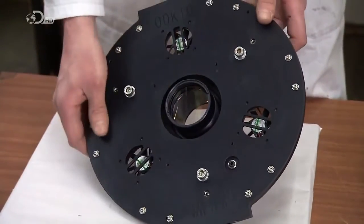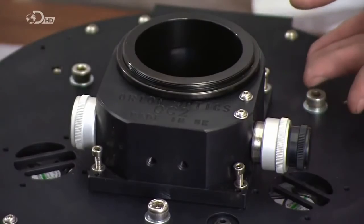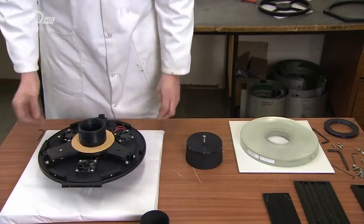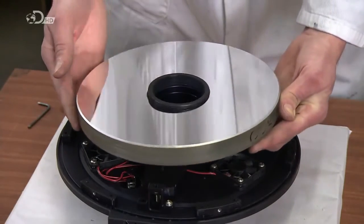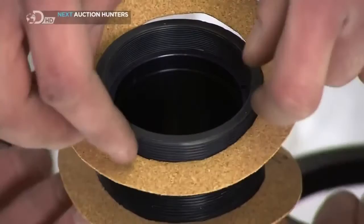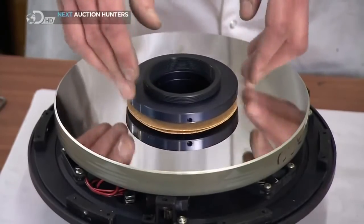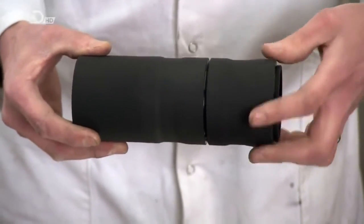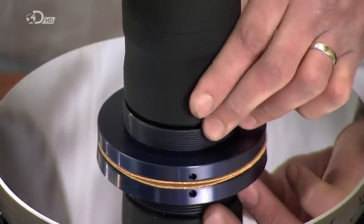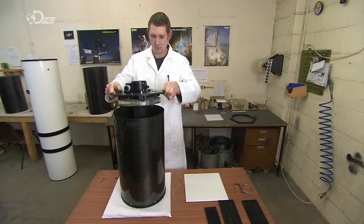Next, a technician screws lenses into the metal housing for the primary mirror. He adds a mount mechanism for the eyepiece, complete with dials for focusing. He flips over the assembly and slides that precision-made mirror onto the housing. A cork ring cushions the mirror so a retaining ring can be installed without a scratch. The telescope's primary mirror is now secure to the housing. He pieces together the three-part baffle, then screws it to the lens holder, protruding from the center of the telescope mirror. He joins the baffle and mirror assembly to the telescope tube.